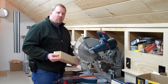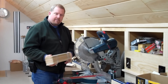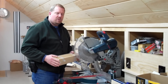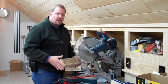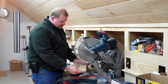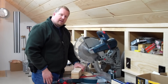After you've ordered all your materials for the shutters, one of the things you'll order from Rockler most likely are the louvers. They're going to send them to you packaged up like this. They will have cut them to a rough dimension slightly larger than what you need, which is actually a good thing because the ends are all kind of rough and not very square. So you're going to want to trim them to length on the miter saw and get them all ready for drilling and putting together the shutters.